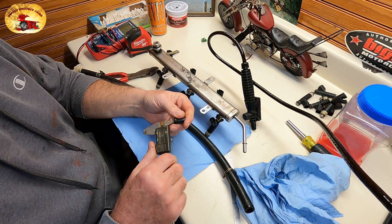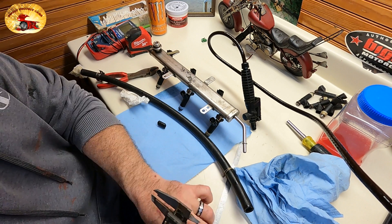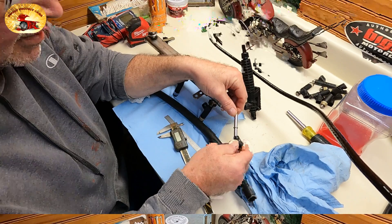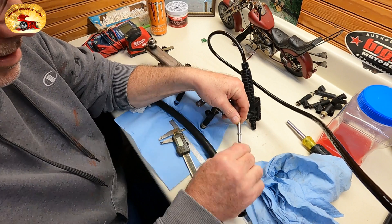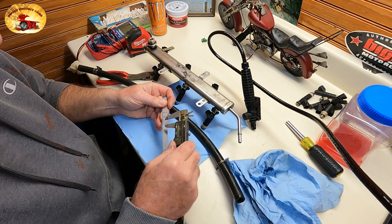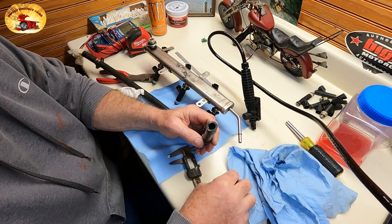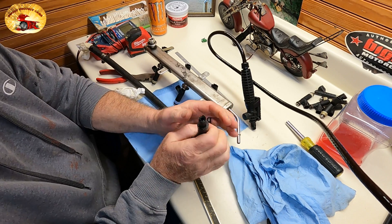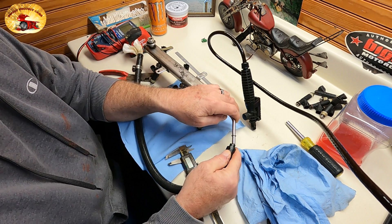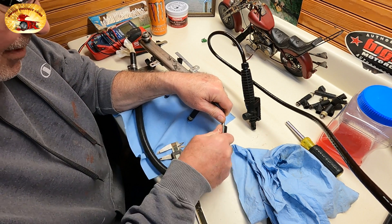I like to use a pair of vernier calipers to measure the inside. Using a machinist scale: 250 thousandths, so it's quarter-inch — that would slip over that. Then this goes in here; the outside is half inch. So you need a quarter-inch inside, half-inch outside adapter. That goes in there like this — you put it on halfway, then slip it on here, and by the time you get it all the way up, the other pipe inside is already in there.